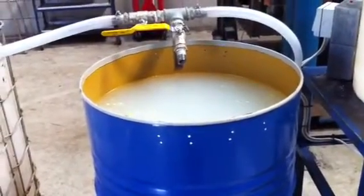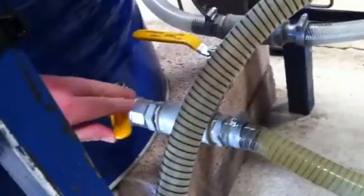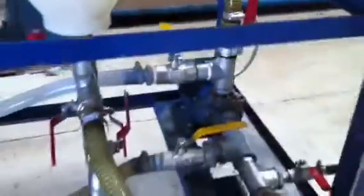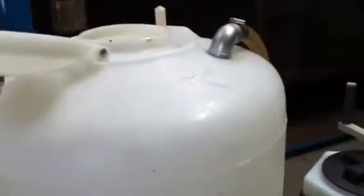What I'm going to do next is turn the valve gear to do that. I'll turn this valve on, which is the valve allowing water to come out of the 200 litre tank. Then we'll turn this valve on here, which allows water to come through the pump and into the reactor. So water's going to come out of the tank, down this tube, through the pump, and up that pipe there which feeds into the top of the reactor. I'll just turn the pump on.